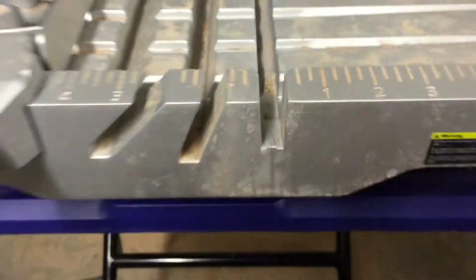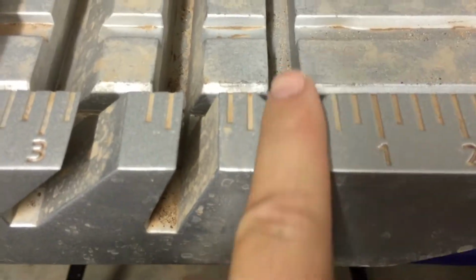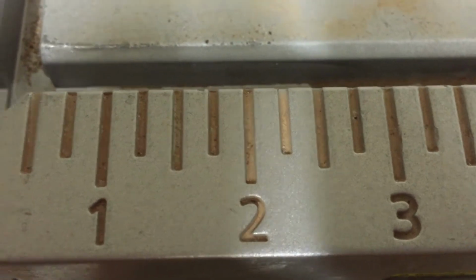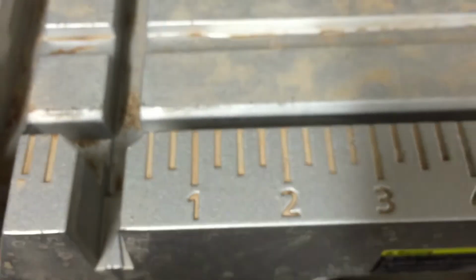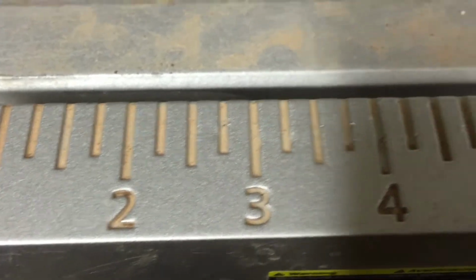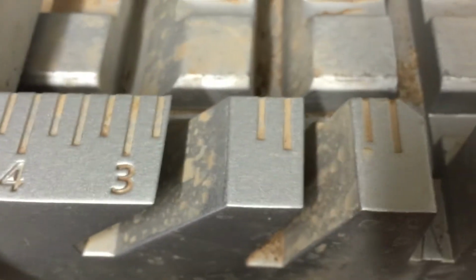Well, let's just start. Okay, you have this guide along the base. It's somewhat helpful, but most of your real tight measurements are notched out. When I first started using it, I thought, what the heck are these guide marks so wide for? I mean, they're darn near an eighth inch wide. And so I'm trying to build a Swiss watch here. So how's that going to be accurate? Well, as I used the saw, what I realized is those things are the width of the blade. So if you just pay attention, you can strategize and use that to your advantage and know exactly where your blade is going to fall when you're trying to make cuts. And it worked out pretty cool, actually.